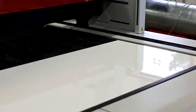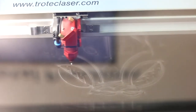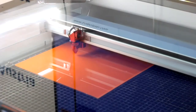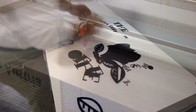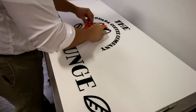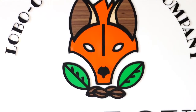Now, let's move on to our main sign. For the base, we've used Trotec White Cast Acrylic. We've kiss cut the design onto the base in order to see the positions of all the top pieces. We've used a combination of wood and colored acrylic to create our design. We've removed the 3mm adhesive backing from the top layers and stuck them onto the white base.